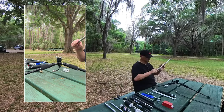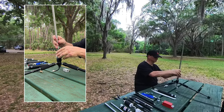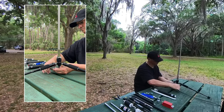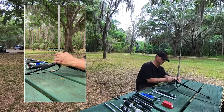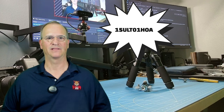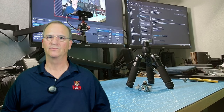No discussion about this tripod is complete without considering — just grab your MFJ1979 or your Chameleon Antenna SS17, put these full-length antennas on this to get resonant on 20 meters, attach your ground radials, and you are good to go. Yep, that was a lot of antennas. If you're watching this video before May 7th, 2023, here's your discount code to go buy this tripod system at the G Gable Radio site on the Amazon store. I'll leave a link in the description below. Thanks for watching, friend. Talk to you soon, 73.